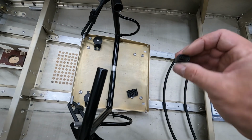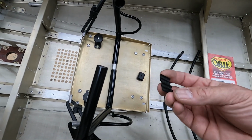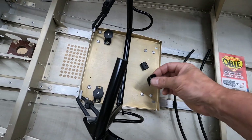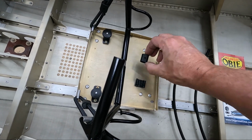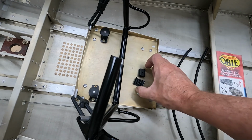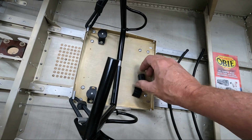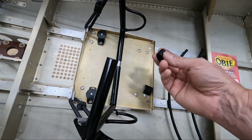This is tapered. It's got a little arrow on one side, so it only slips onto one side. You basically put this clamping securing mechanism over the top of two cords like this, and then you slide it inside of this sleeve. So you press this sleeve on top, and this is tapered on one end too, so I noticed that you have to be careful. It's actually thicker on one end than the other. So this goes, say, this direction, and there's an arrow on here that goes this direction. Once you clamp this around the bungee cords, you can start sliding this up, and then you take a pair of pliers between the plastic part, once it's folded over like so, and the base here, and you can slowly slide them together on each side, and it basically just pinches the bungee cords in between here. I think this is going to be very secure, provided this connector doesn't break.